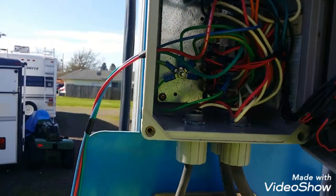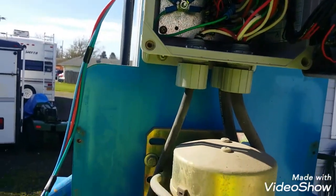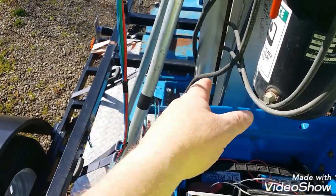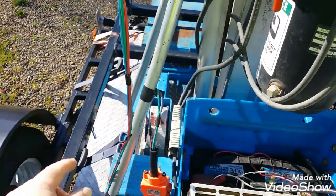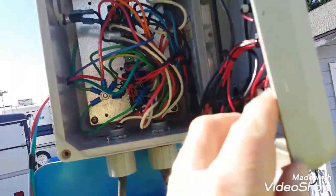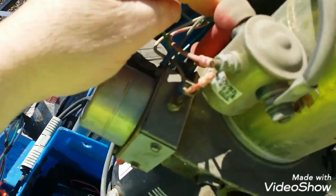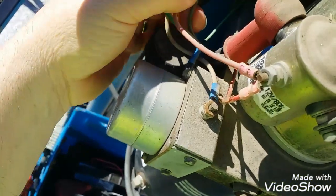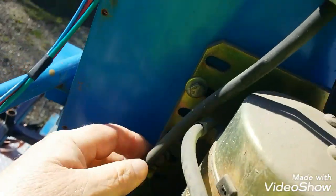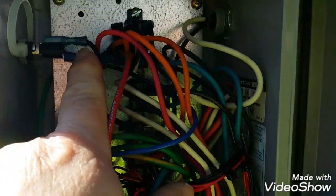Well gang, it really didn't take long to figure out. I'll show you how this was wired and explain it in case you ever are working on a piece of equipment like this. So the safeties — there was some sort of a level eye sensor, and then there's a sensor on all four corners. Evidently how this thing was wired is basically it took the 12 volt, which comes from this connection directly to the battery — and in this case it's this black wire right there — it goes up this cord through this fuse here.